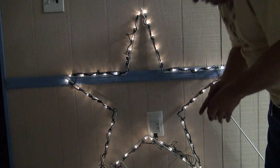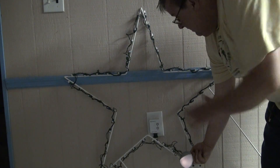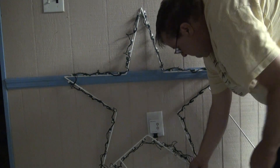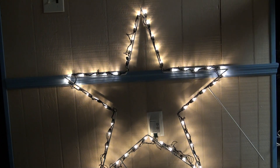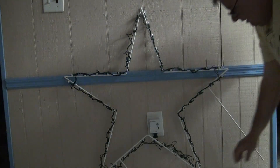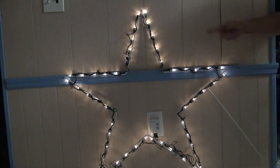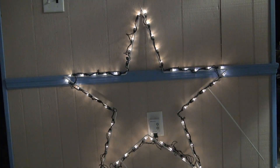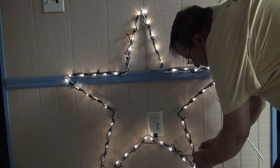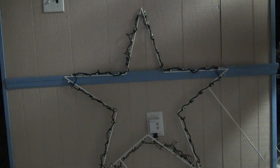Here I'm going to demonstrate with an LED nightlight, because it's actually going to show where the power goes. I took it from this and plugged it into this — my X10 controller. On, off. Now take the snubber or nightlight out of the circuit — you see how it came back and bled through. On, off. Snubber back in — there's your light, there's your bleeder current. On, off.